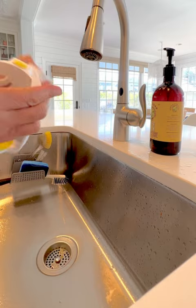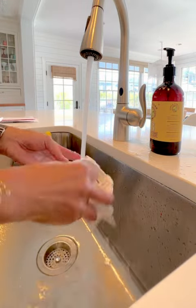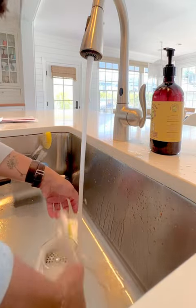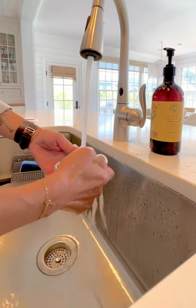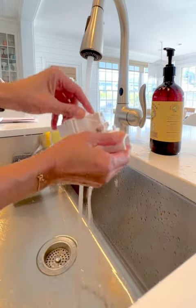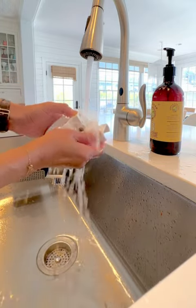So what I'm going to do is turn this faucet on and let the force of the water hit the sand, and then I'm also going to use the tapping to get the loose sand out. Another thing I'm doing is pushing down on the button as the water is flushing through so that the button can extend fully up again, which it wasn't doing before — pushing up and down while the water is flushing through it.